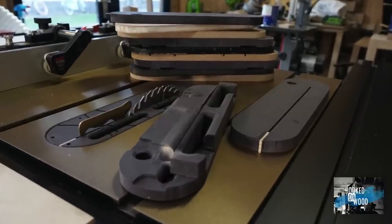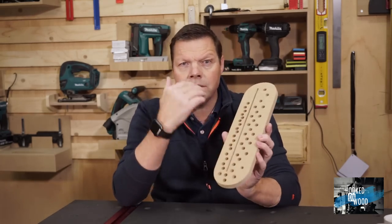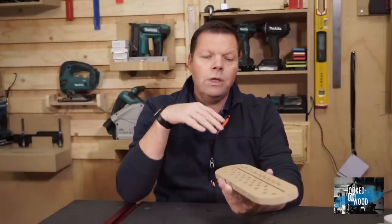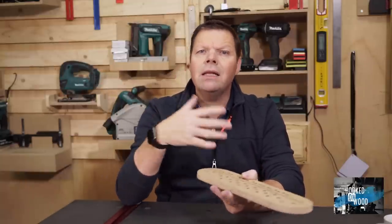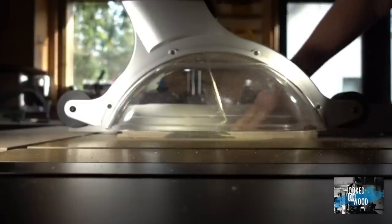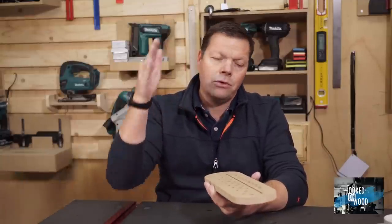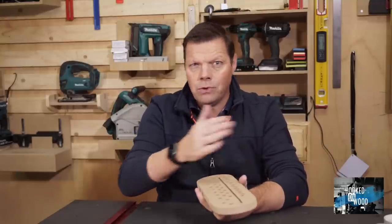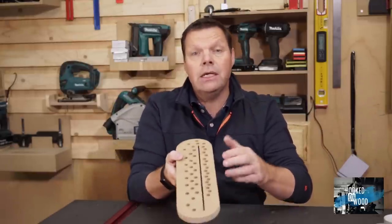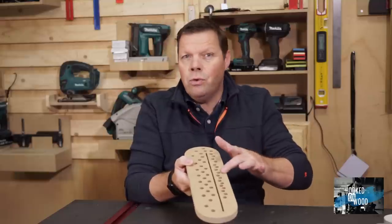So I made a lot of different designs. I started by making a Zero Clearance Insert with a lot of holes. This way I could easily cover some holes and areas, make a cut, and see what happens. I recorded all these cuts and simply looked at what happened. What I learned from this trial and error method is that holes at the right side — if your fence is at the right side — do not have any effect. They only create a disadvantage because the wood is sucked to those holes, giving some friction. So forget holes at the right side. The most effective place is the other side, and unfortunately there is not much space, but for dust extraction this is your most important area.